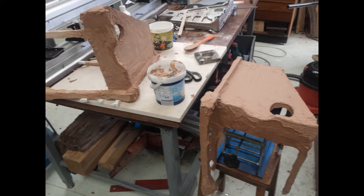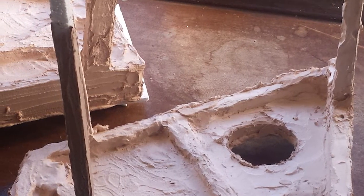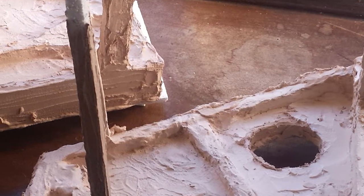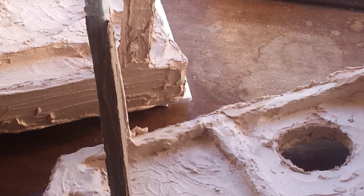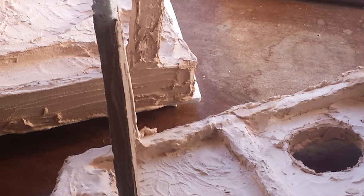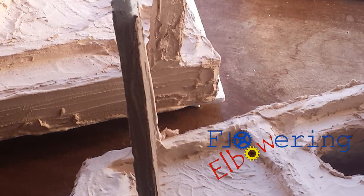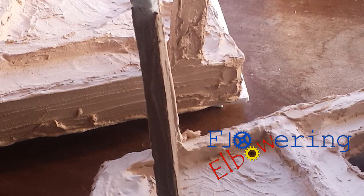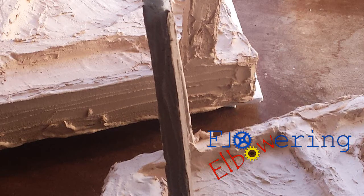Here are the two end plates for the CNC machine gantry that I'm making. They need to be completely dry before pouring the aluminium, so these are left on a window shelf by a radiator for a good few days — you really don't want any moisture in them when you pour the aluminium. That was making the foam patterns. If you want to see the casting process itself, click on the link. Thanks for watching.